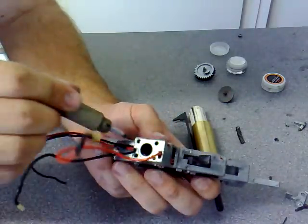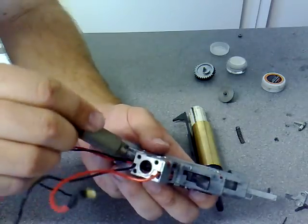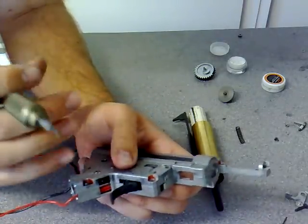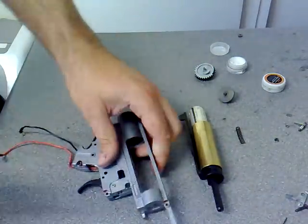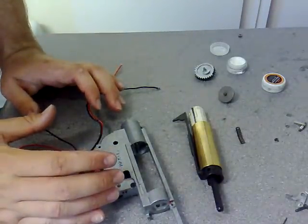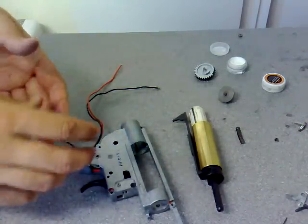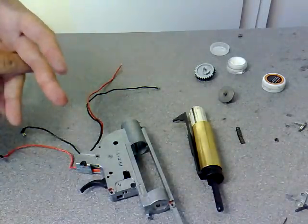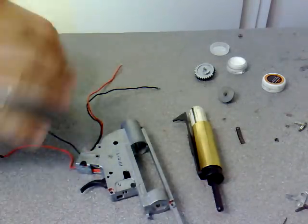And then obviously we can poke a screwdriver in here and turn it a little bit. The fact that it's effortless to turn here means that when we start adding heavy pressure components in there like springs, it will still be effortless to turn. Really, we shouldn't have to resort to grease in order to get free movement. The tolerances and all the shimming should be perfect so that it just spins freely. If you removed everything like the cut-off lever and the anti-reverse latch, you could just flick the gears and they would, in theory, keep spinning like a wheel on a bicycle.